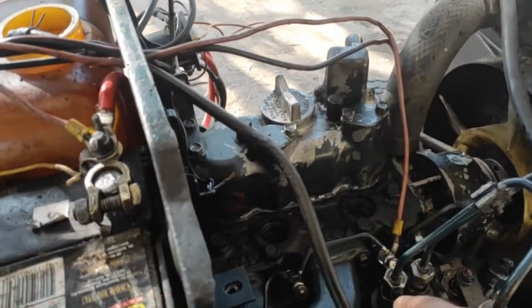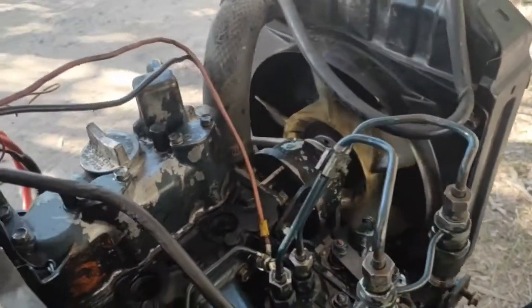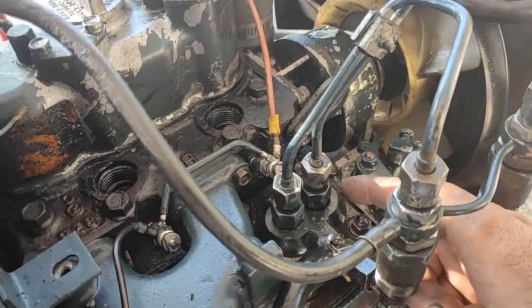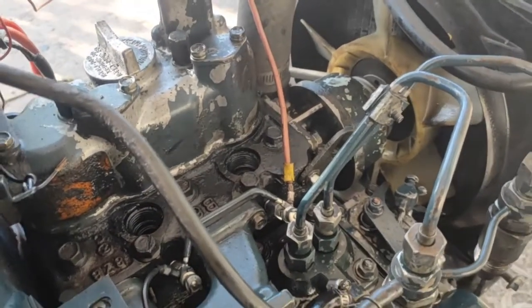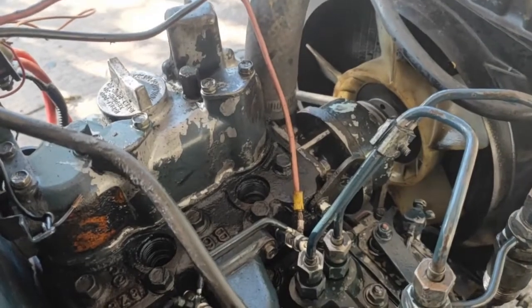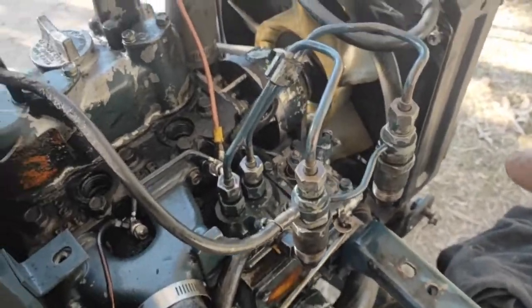Firstly, I had a leak inside there. Happened to be a little O-ring that fits at the end of the, so you pull this out after you take these off, and you put an O-ring there, and it sealed it up fairly well. Just be careful, there's a spring and a couple of bits in there that can fly off, but it wasn't too hard. Anyway, as you can see, this is not the way it's normally set up.